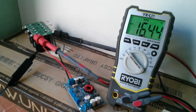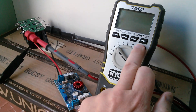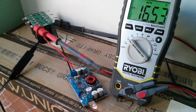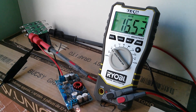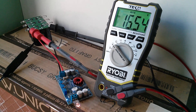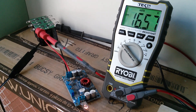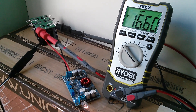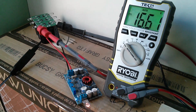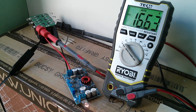Now I've got a situation where the lamp is on. I've had to drop the brightness a bit, but there is now enough power coming from the solar panel, which is in full sun, to have the voltage on the supercapacitor rising even with that load switched on. That's assuming the supercapacitor doesn't switch its own protection circuits on. None of them are on at the moment. So yes, with maximum power coming from that solar panel, or very close to it, we can sustain that little filament lamp and have a rising voltage on the supercapacitor.